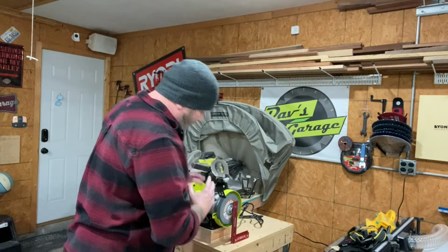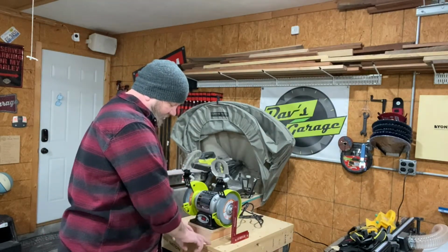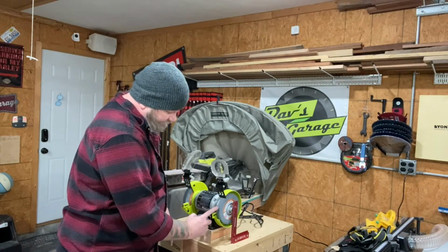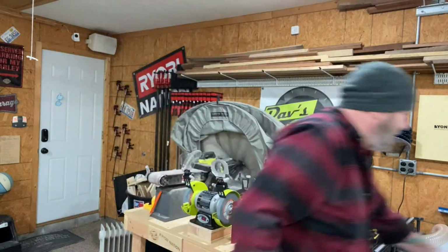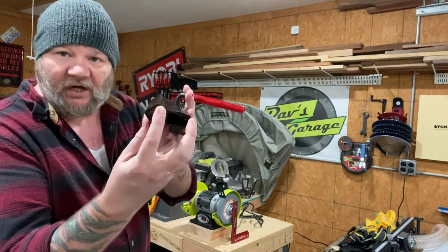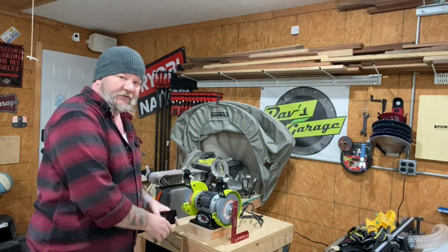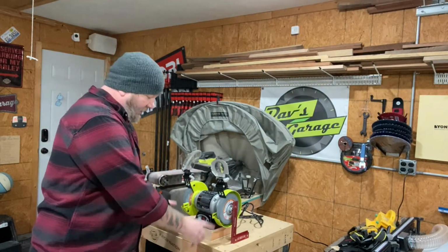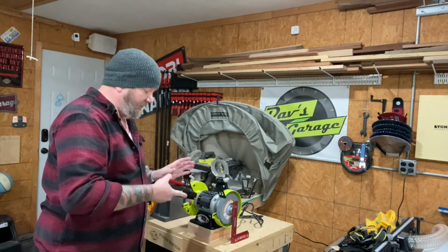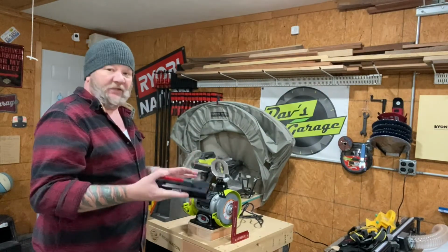Now I need to do the rest of the centering, which means I have to get this plate 1/2 inch from the edge of my surface, and I have to get the mounting bracket here. This little portion of the diamond needs to be perfectly centered underneath each of these grinding wheels. So now I need to find centers on those, then get them transferred down to the table, and then I can start placing these in their locations. And then once I have them in their locations, I can get everything bolted down and we can proceed to the next step.